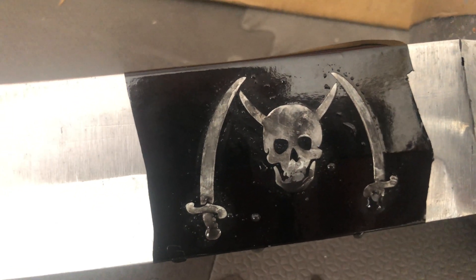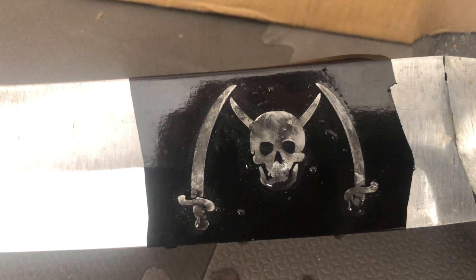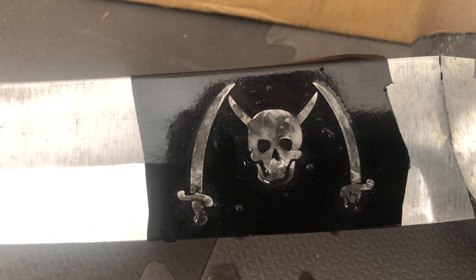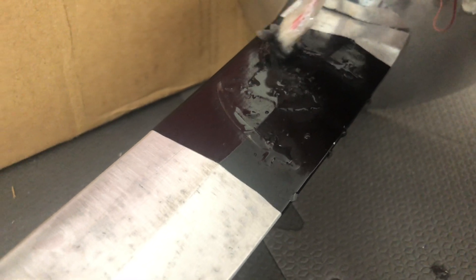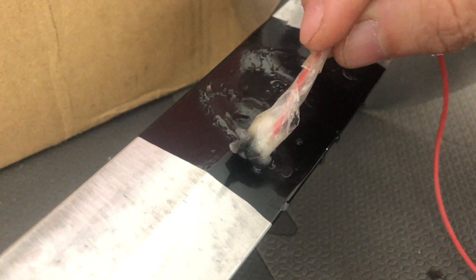I'm continuing the process — I'm using my other hand to keep the leads connected to the battery, which is why I can't film at the same time. It also gives off fumes, so don't breathe them in; make sure you use a well-ventilated area. I found that by tilting the blade upward, the acid pools on top and I can brush across it, which gives a nice deep etching rather than letting it drip off. You can hear a little sizzle and see it bubbling. This takes about five minutes, but on a high-polished surface it doesn't need that long — since this blade is going to be beat up, I want it to really stand out.